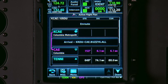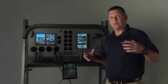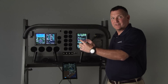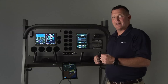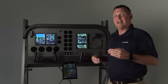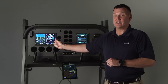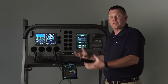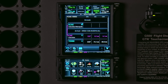Once we're in the air, the Flightstream 510 can help by pulling together numerous sources of useful information for the pilot, including keeping all your screens GPS coordinated, all screens showing synchronized ADS-B traffic from your GTX 345, and all screens showing synchronized AHRS or synchronized synthetic vision. Not only is your G500 using that AHRS, but through the Flightstream it's sharing that same certified AHRS information with the two iPads running Garmin Pilot or ForeFlight. A synchronized cockpit means less pilot workload on every flight.